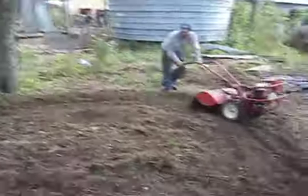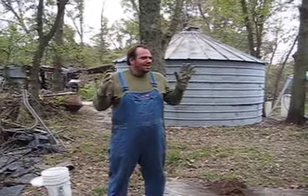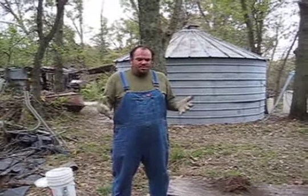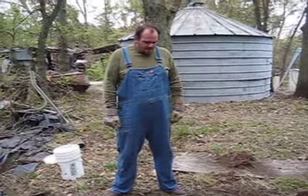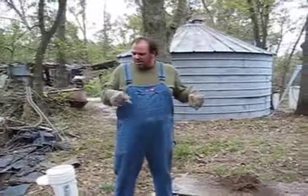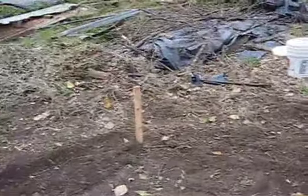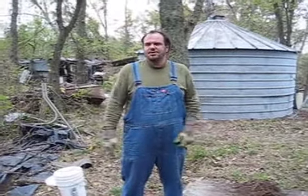We'll level this ground after he's mixed it up a little. This is Alex's hexa yurt, and we are doing our very best to mend the soil and figure out how to make it last as long as possible with materials imported to the site. We're going to use this fly ash on the ground to stabilize the perimeter, and we're going to hoe between the points — seven foot four inch sides — mixing the fly ash into the ground. Then the rain is going to come down and harden it for us. That's a very simple method for stabilizing our foundation along the perimeter without spending a lot of cash.